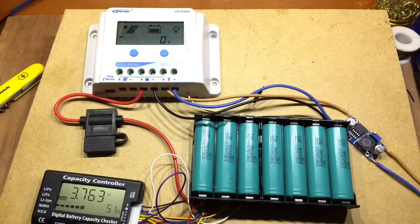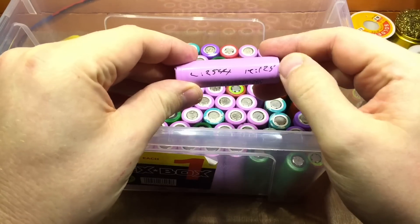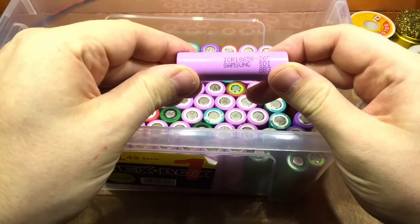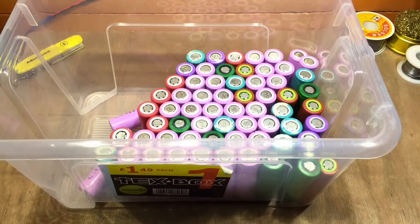I think it's time for an expansion. Despite the recent snow I've actually been planning this for a while, and over the last few weeks I've been recycling 18650s. Here's my box of them — every single one has been tested for internal resistance and capacity. 2544 milliamp hours on this Samsung cell. Out of 15 or so laptop batteries I've prized open, I've got 60 good cells that have been sat for a few weeks.